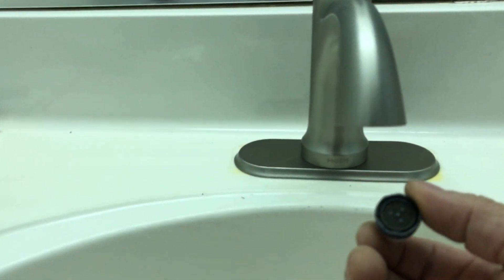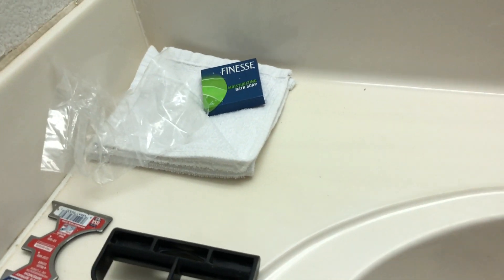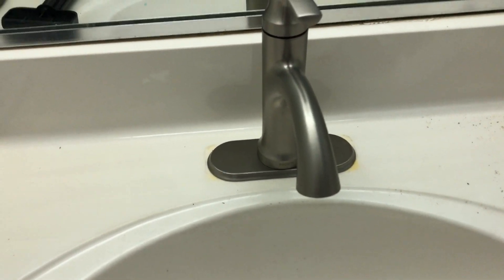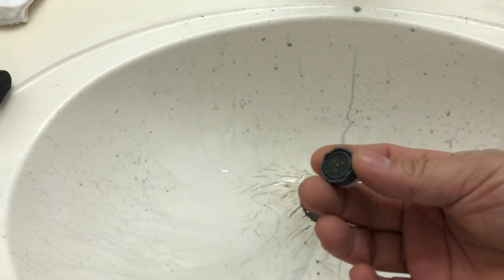Always, when you close your water and open it for the first time, make sure you remove the aerator screen first — it's going to get clogged because there will be a lot of rusty red water and metal sediment that comes out. So clean the bottom a little bit so we don't want it all going down the drain and clogging it. See all the black water that came out? That's why you need to remove your filter first, so all that dirty water can flush out.